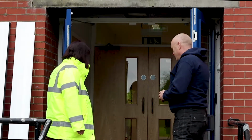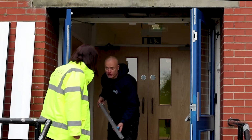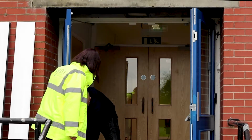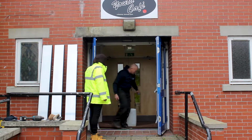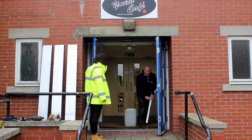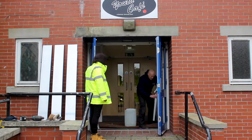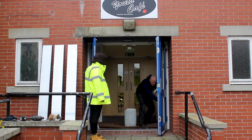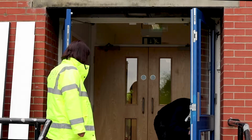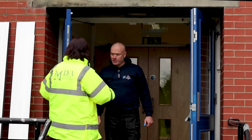So what have you done so far? Well, first of all, we've taken away a little bit of architrave, so the actual rails can sit neatly against the wall. On this side, it's fine because it is vertical. On this side, we can put a little bit of backing and bring it vertical. This means that we can then cut the boards perfectly, all three boards, instead of individually, and it also looks aesthetically nice as well, because it has to work. So what we use is just backers to bring it out, to bring it vertical. And then when you've done that, you can obviously start to put these in.